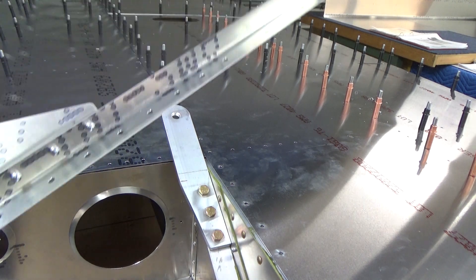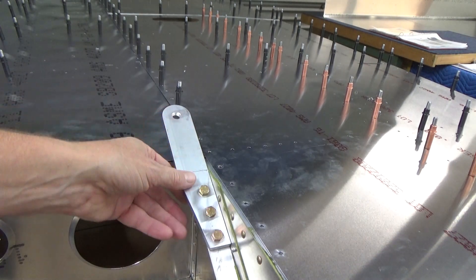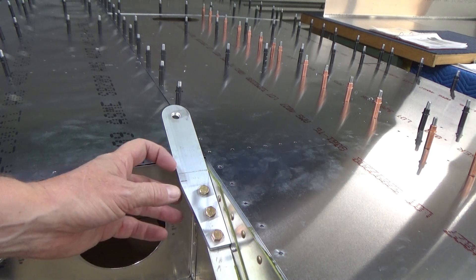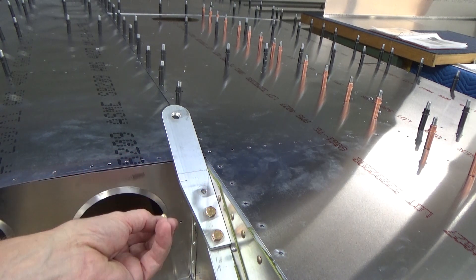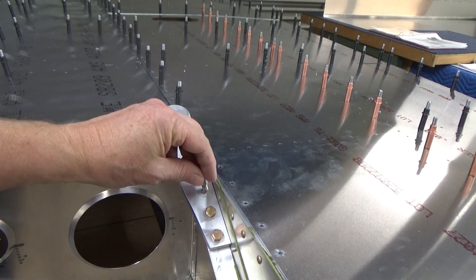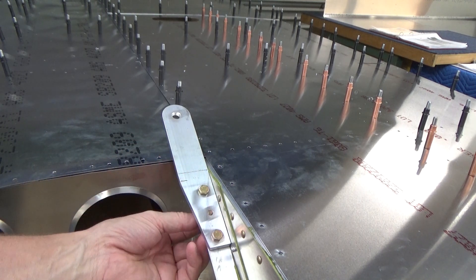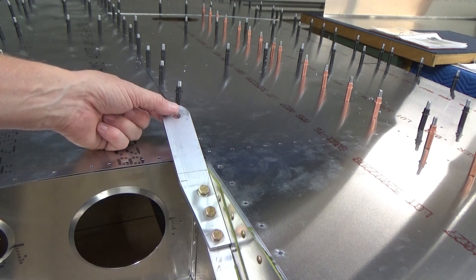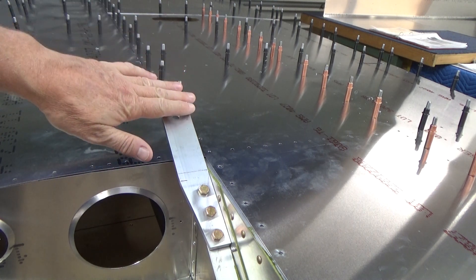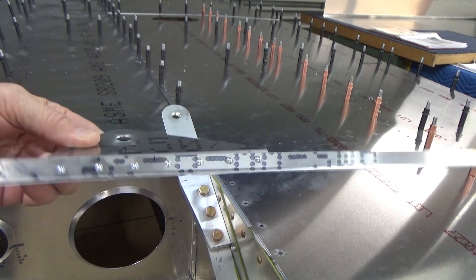Right hand wing, bottom surface. I've been working on this upper strut attachment bracket - the bolts are just sitting in there for the sake of this video. When it comes time for final assembly, standard practice has bolts facing downwards. This one here may have a clearance issue so it may have to go inverted, but the other two will definitely work. With a washer each side of the nut, we'll bolt that on and torque it up correctly. This is the wing strut main attachment point - the wing is upside down at the moment, so the strut runs off to the undercarriage.